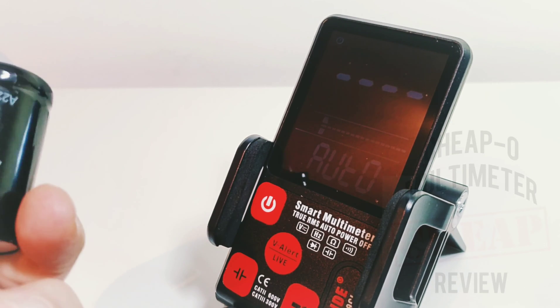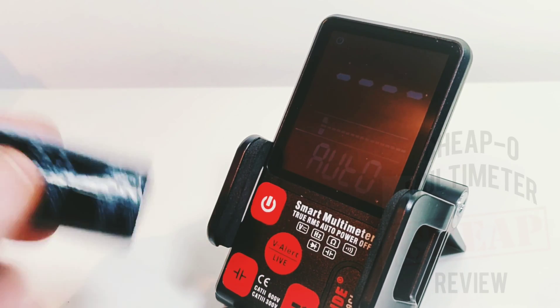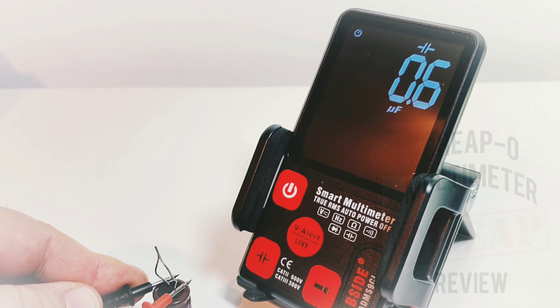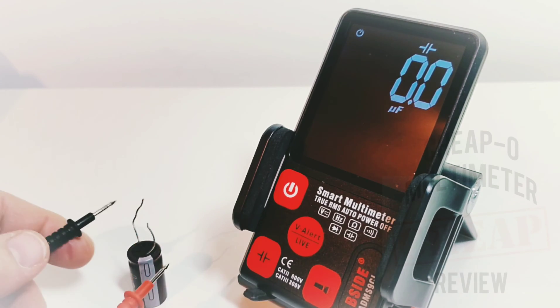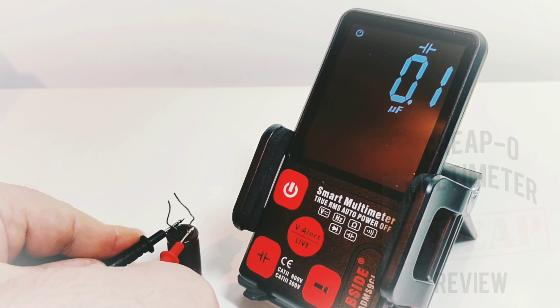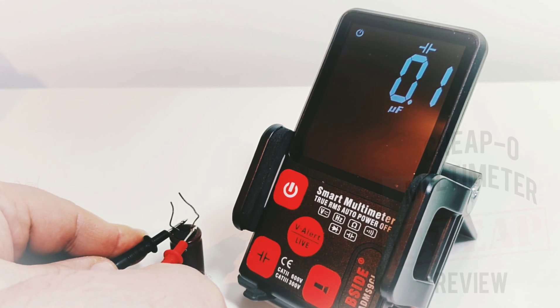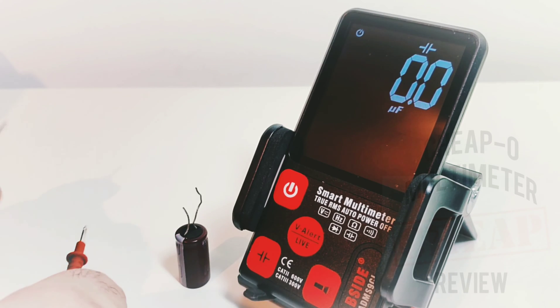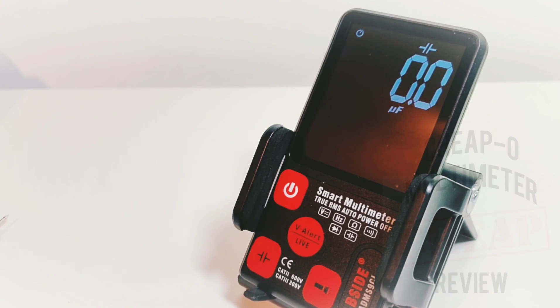Is it so fast? Here we go... wow, one second. Yeah, okay, it was pretty lame. Obviously it is not the fastest. Let's try it again — 4,700 microfarad, 4.7 millifarad. We're still in the microfarad range... there we are, 4,511 microfarads. There's no hold on this meter. It was okay, but it was not lightning-fast.